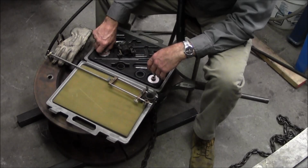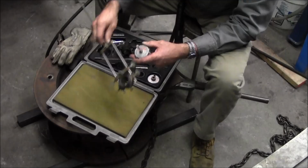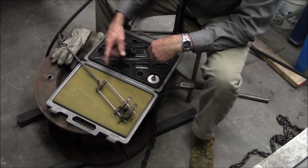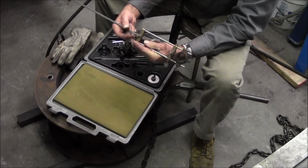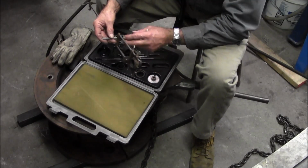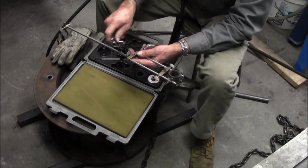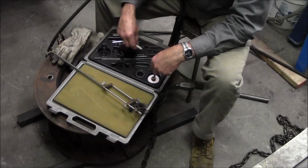This kit pivots in the center, and you have a suction cup here and a square that pivots. This would mount in your circle cutter, or come on over here and mount in this one over here. And I've got an extended rod in here. Normally you can run a regular point right here, and this point here, and then you can slide this inside, have your guide on the outside. There's a lot of combinations. This is almost like one of those gasket cutters, the bronze body gasket cutter, a real nice unit. Same kind of theory in adjusting it in and out.